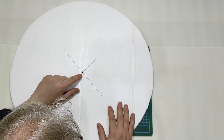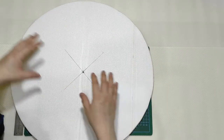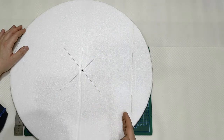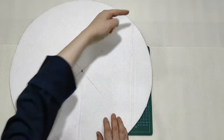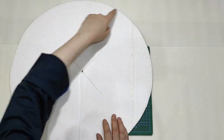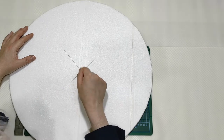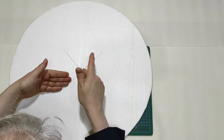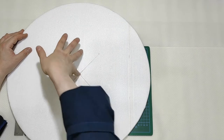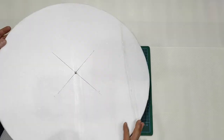Then in the center there, that's the reason for those lines. When you have a square or a rectangular shape, it is easier to trace the center by joining the diagonal points, the opposite corners. So I did that and then cut around. The lines marking the center of the disc are still there. I used a compass with an exacto knife to cut everything around.